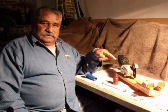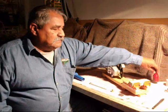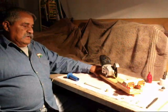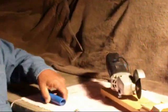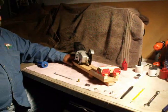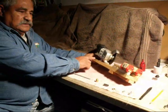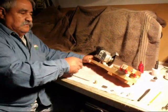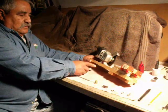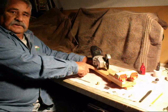So what I put together here is a simple hole saw sharpening tool — just a simple jig. It's made using a regular grinder with a metal cut-off disc. You unscrew the handle that supports it, and you make a hole in a 4x16 blank of wood with supports on the bottom. You run a bolt through here with a nut at two locations to tighten it.